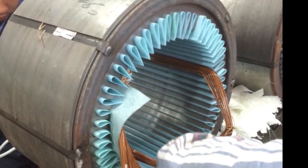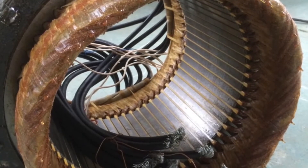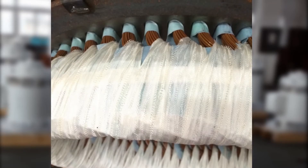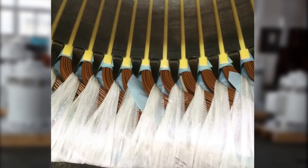In the interior, you will find epoxy-coated rotor and windings which have been VPI treated, inverter-grade magnet wire that meets NEMA MG Part 31, spike resistant to 1600 volts with 10-to-1 variable torque capabilities and class F insulation.